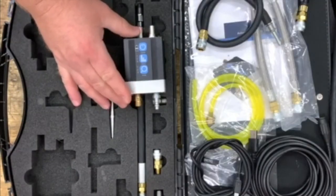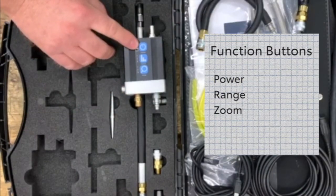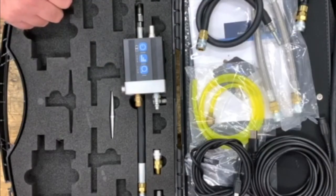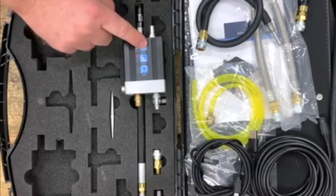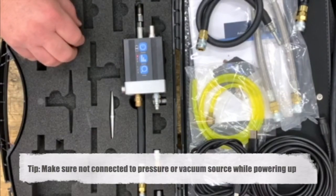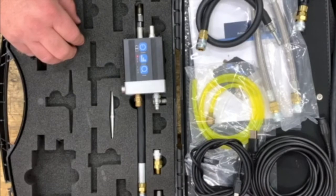The face of the transducer has a power button, a range button, and a zoom button. To power up the transducer, depress the power button for one to two seconds. It is important that the pressure transducer not be connected to a pressure or vacuum source when powering it up so that it can complete its self-calibration. Once the indicators have stopped blinking, the transducer has completed the calibration and is ready to use.